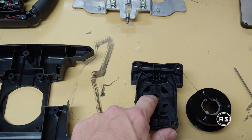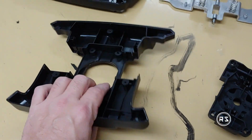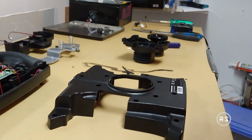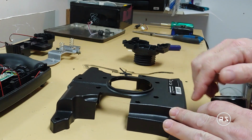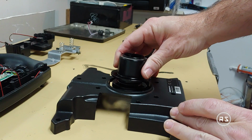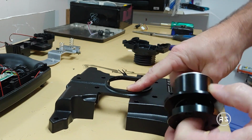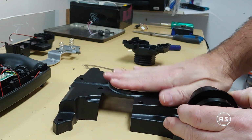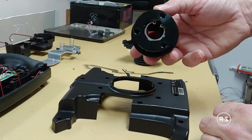And I will make a hole because 3/4 inch is 1/16 too thick, but for my quick release, to be fit in, it needs to be flush with this lip. If it's deeper than that, the quick attach will bang into the frame of the wheel and I won't be able to remove it. So by sculpting that hole, my piece of wood will become flush and I will screw my quick release onto the plywood,